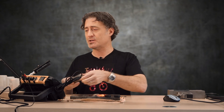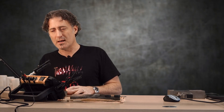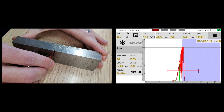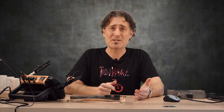Let's take this three quarter inch steel block. It's got a two millimeter and a four millimeter notch on it. I'm going to use this five megahertz half inch transducer with a 45 degree wedge, shoot through the block and hit that two millimeter notch on the other side, and draw that echo dynamic. If dB drop was going to work for height sizing, then when I flip the block over and do the four millimeter notch, we'd expect that echo dynamic to be a lot different. But you can see the echo dynamic is almost exactly the same. That shows there's no difference between the two millimeter and four millimeter notch for dB drop, because really both notches are smaller than the beam width. So we're really just doing a beam profile.